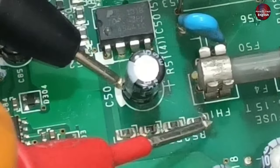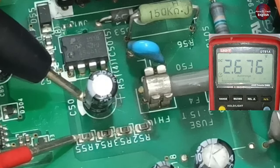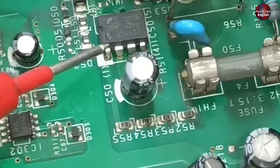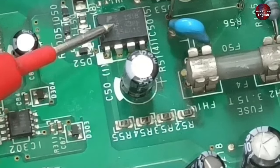The 4 resistors mounted here are half megaohm resistors. So 2.6 volts are passing across these resistors, which means that pin number 1 is also perfectly fine. If the current increases at pin number 1 of the IC, the entire IC will shut down, eventually turning off the entire circuit board.